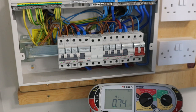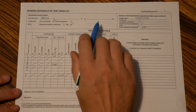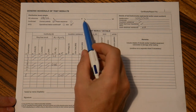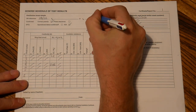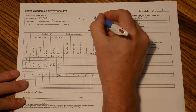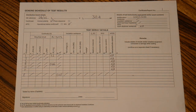So let's go to the sheet and have a close up look. On the reverse of my test sheet, at the top we have Distribution Board Details. We have IPF — our prospective fault current — and for our test we had 311 amps. It does say kA there; we crossed it out because we're not converting it into kiloamps, so 311 amps. We'll just leave it as amps for our prospective fault current.